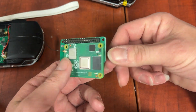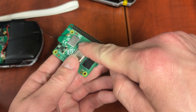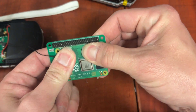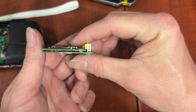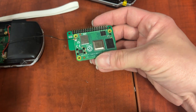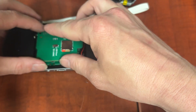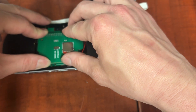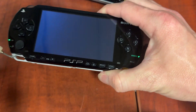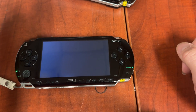If you look really closely it'll look like it's a little bit higher close to the GPIO pins. But if you press firmly close to the GPIO pins you'll hear the CM4 click properly into place. Often times I find that it's clicked in on one side well and not the other. And when we plug this carrier back in and turn it on, you'll see right away we get power light and backlight comes on, and shortly after we get the activity light and not long after that we're booting.